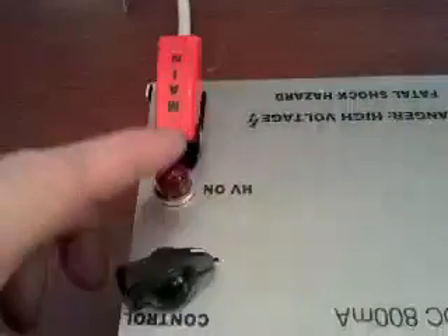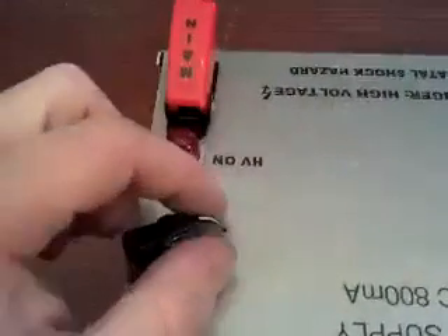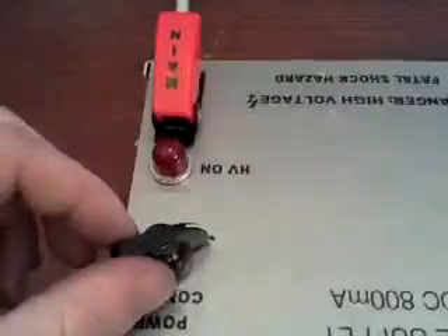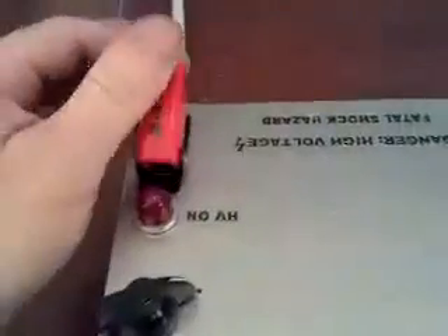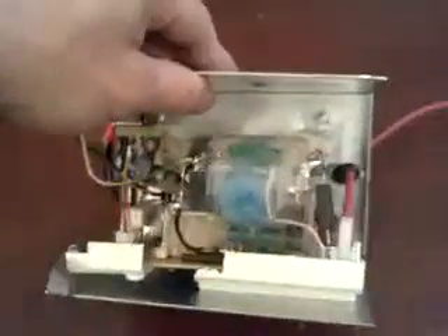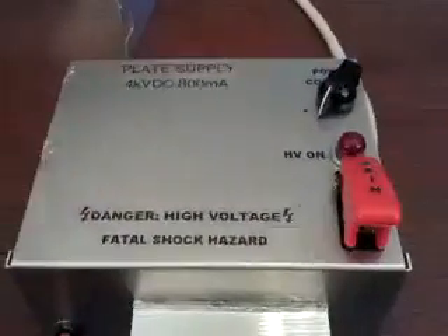Up here on top, I have a neon indicator that shows when power is on. I've got the power control with a little mark indicating the lowest setting at which the inverter will start. Of course, you could use trimmer resistors on the pulse width modulator to set the endpoints, and that would probably be better, but this is what I did. I've also got a safety cover over the power switch, which is insulated and allows easy turnoff without contacting the case, just in case. And there are appropriate warning signs, because this thing really, really requires caution — it's a very dangerous piece of equipment. Doesn't get a whole lot more dangerous than this in a home lab, actually.